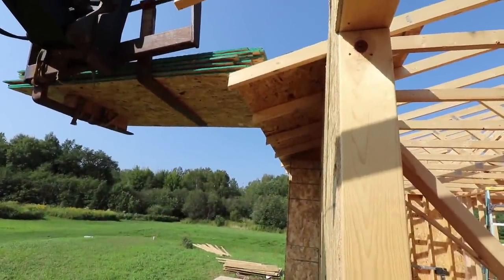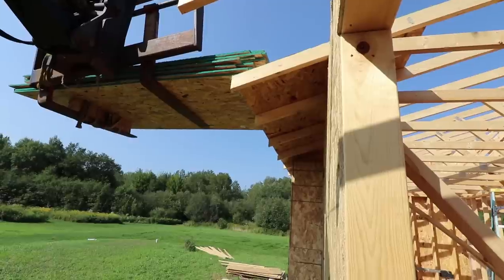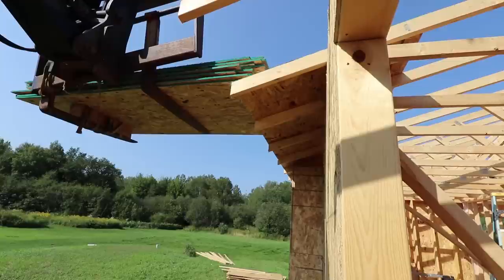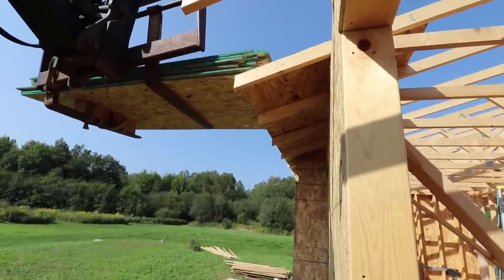If there would have been two of us here, I would have put the 2x6 subfascia on first before I did any of the plywood, because I can put it all up there and nail it all from the top then. Now I'll have to come in afterwards, but being just a one-man crew on this one here,